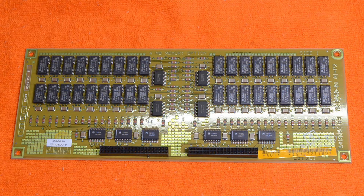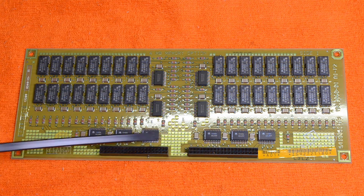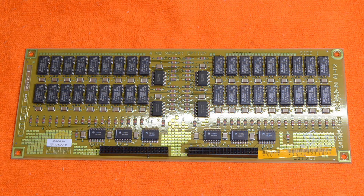Here's another familiar board. This is the 4MB memory module from a VAXstation 3100. They normally come in a pair with another board that's sandwiched on top of this — so there'll be a 4 and an 8MB board sandwiched together, plus 4MB on board makes 16MB. I show these boards in my VAXstation 3100 video.